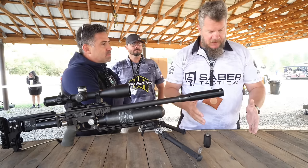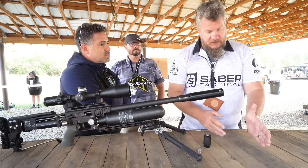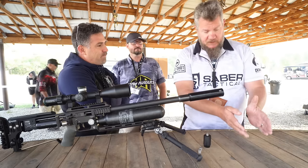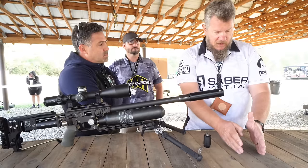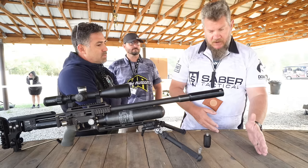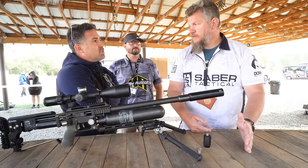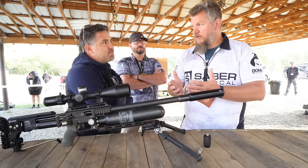In my case, it's looking pretty good at three, the third one over on the first rotation. It's looking a little better at four than it's looking at two. So let's go back to the bench and go from three to three plus one hash, three plus two hashes, three plus three. It's like zooming in on it, making smaller movements. Now we're doing smaller adjustments.